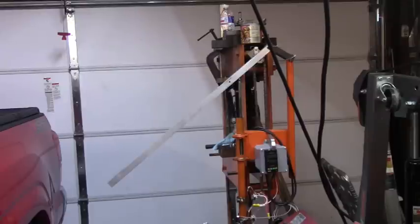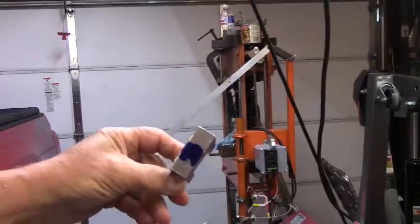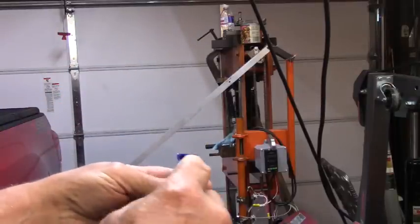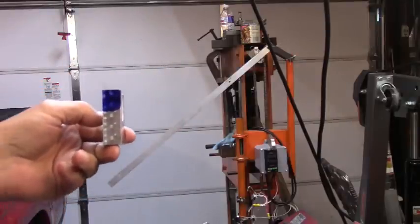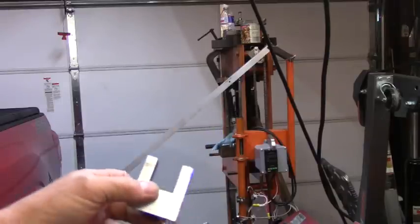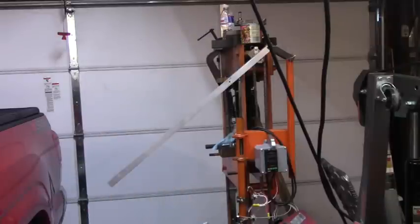In the redoing of that handle there, I made a little yoke to go on the threaded part. I'll drill this and thread it to the 1/2 inch 13 that rod is. Then I'll drill a hole through here for the little pin to hold it against the handle. And I may have to move the hole on that handle to a different spot. I'm not really certain about that, but once I get that done, I'll make a couple little clamps to hold my mold together, and we'll melt some plastic. At least that's my plan.